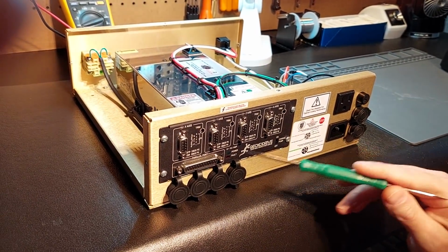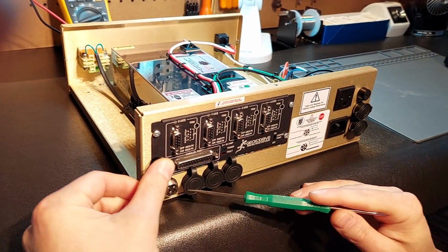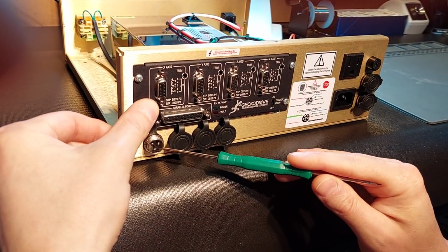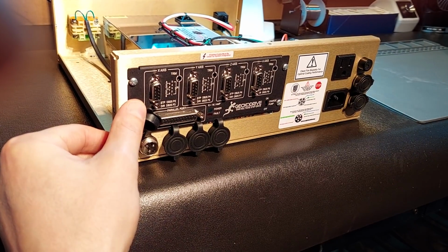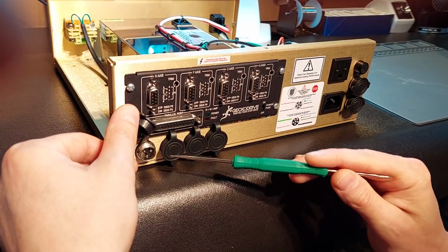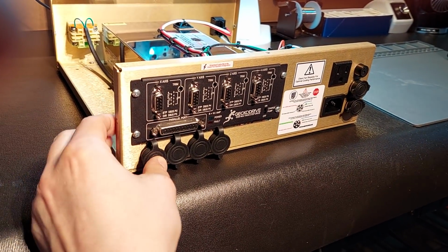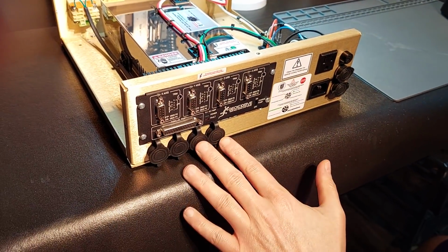Okay, so we've got the G540 here, Master Edition enclosure. If you're not familiar with it, it allows for all of the options the G540 supports. So these GX16 3-pin ports are designed for your switches or your touch plate. Why are they using 3-pin? Two of the pins would be allocated to your switch. The 3rd pin is always allocated to your ground for your shield drain. And the ground will be inside the enclosure with the ground bus. Again, we have 4 of these installed.